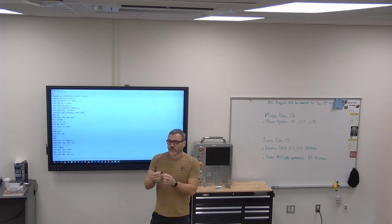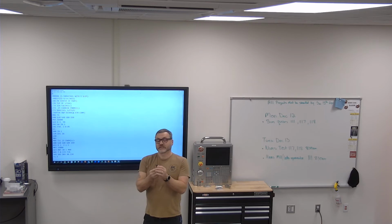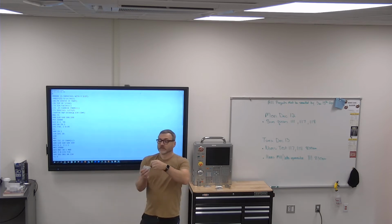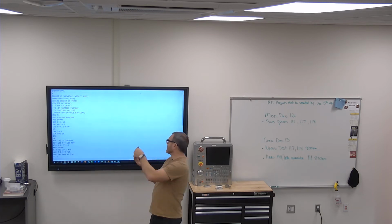So when you set a tool like this, you don't actually measure the outside edge of it. You measure the length of it as normal. And then you're going to put 670 in as the diameter of the tool. It's actually 750 at the outside edges, but at the undercut area, this lower area right here, it's 670. That's the 0.670 work comp. Yes, that's going to be your diameter.